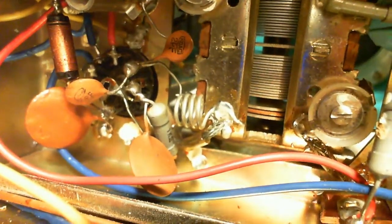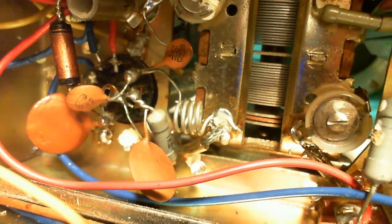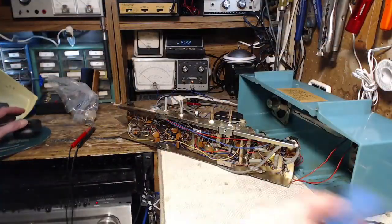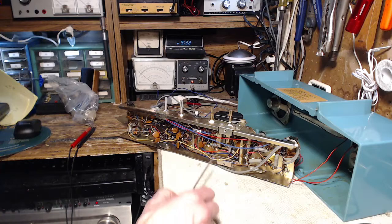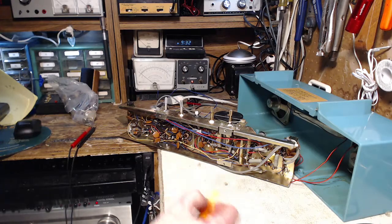Well, let's just read the other two resistors. I see that little tiny guy there, and this big, physically larger one that says 1K on it. I've replaced the one we've measured already on the basis that it's supposed to be 10K and it turned out to be 1K, but that really doesn't explain anything to me about why the radio takes forever to warm up.